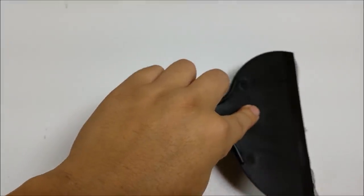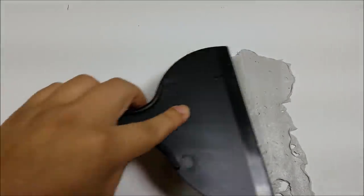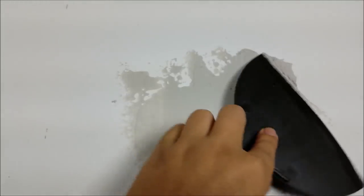We're just going to put some texture on this wall — it's known as a knockdown pattern, there are a whole bunch of different names for it. This is basically where the microwave was hanging over the stove. You just take your trowel and kind of smudge it over like that, make a pattern, mix it up — just some texturing on there to make it look different.